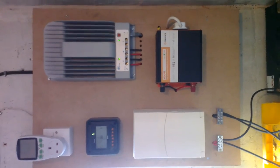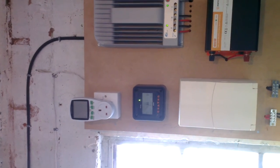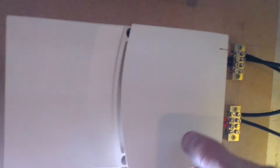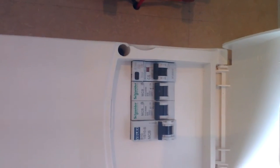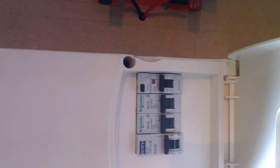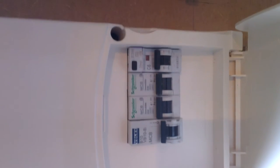I got rid of a switch that was at the top left — didn't need that. I've put a new little monitor in there to see how much power and voltage we're drawing. There's a new fuse box here, a consumer unit. On the right you can see there's a new fuse — that's an RCBO, so it's a 6 amp MCB with an RCD unit. That's what comes out of the inverter. The one next to it is the one that goes into the inverter: 40 amp MCB. The one on the right is the RCBO which comes from the inverter.